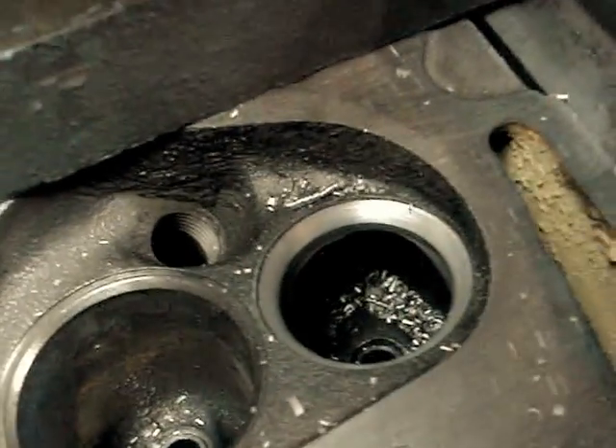Once we're done, you'll see all the chips that came off here. We have a perfectly cut seat with the correct set of angles. We're going to double-check all that — make sure the width and the location and everything is good. Basically, we're going to go all the way across the head and do that. Hopefully, this gives you some insight into what we're doing when we're actually rebuilding these heads.